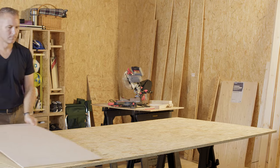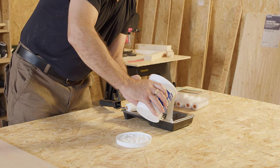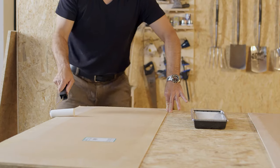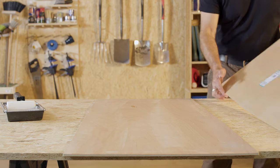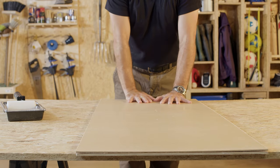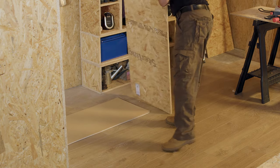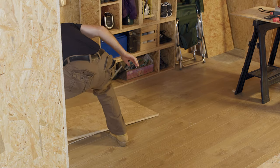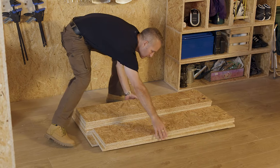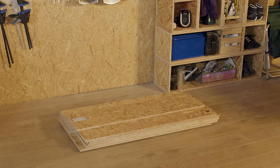The first thing to do is take your sheets of plywood and hardboard. Fill your paint tray with PVA glue and apply a liberal coat to both sheets, making sure to glue the textured side of the hardboard. Be sure to apply the glue to the full surface, going right to the edges. Once you've applied the glue, turn over the hardboard, align it with the plywood, and stick the two sheets together. Apply even pressure across the sheet, then move to a firm, even surface — preferably the floor. Place as much weight as possible on top, keeping the pressure as even as possible, and leave it overnight to make sure the glue has a chance to properly dry.